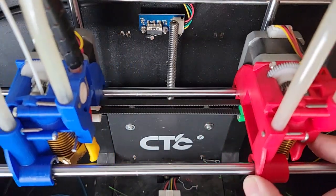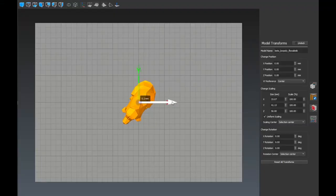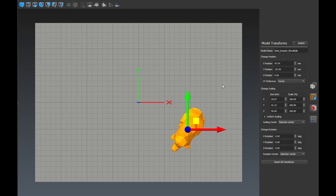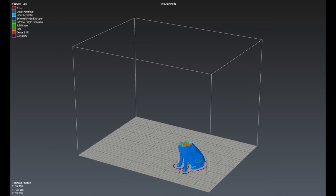And this is where the magic happens. To avoid tool head collision, we have to move the part by 23 millimeters off center, or about half the width of my tool. This is one disadvantage of mirror mode versus duplication — in duplication, you have the full width of your bed.